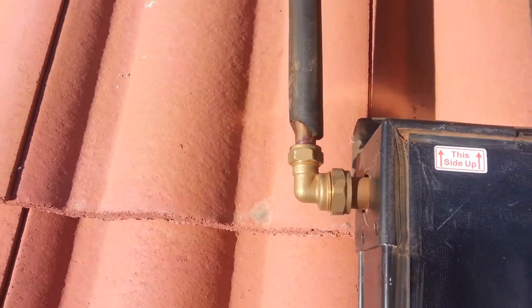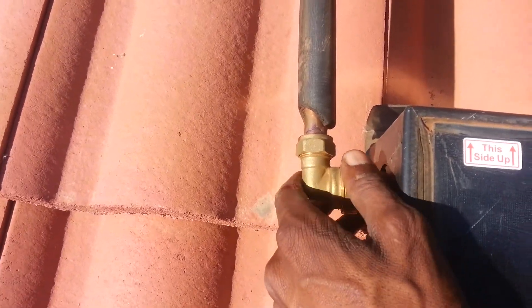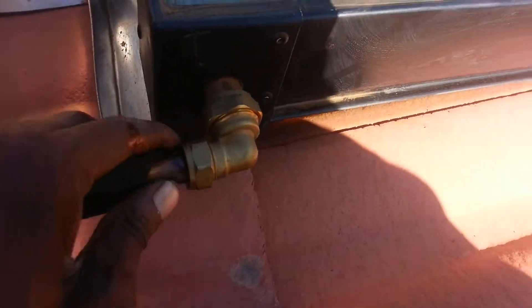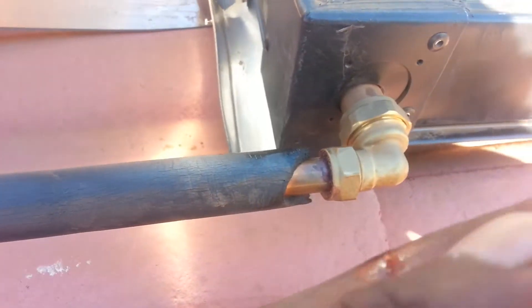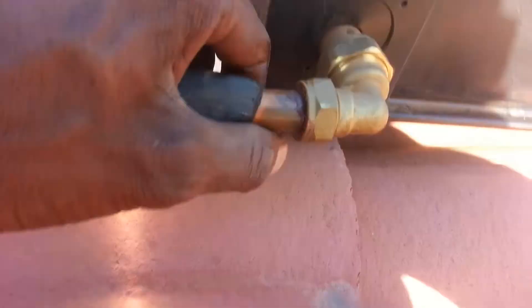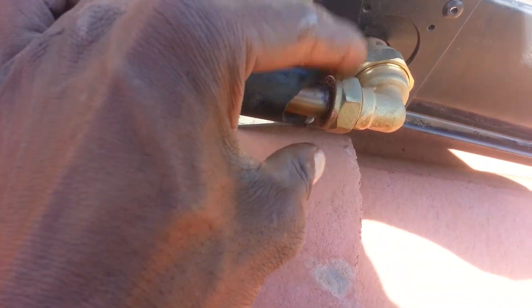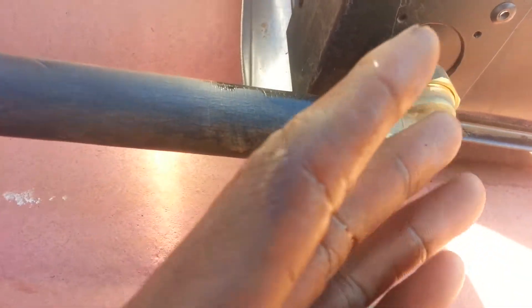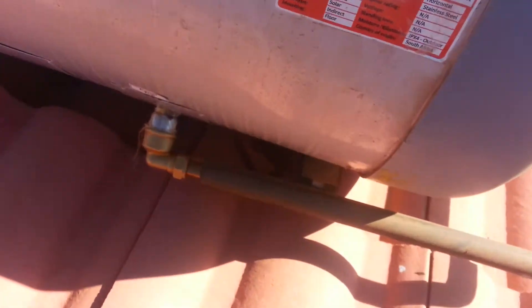Here's the top panel — it's hot, getting water. So we'll take a wrench and tighten it up. As you can see, I can see some glycol here — I think it's been leaking. The glycol has been leaking; maybe this is the cause. This is suspicious. If I tighten this up there should be changes. My fingers are oily, shiny, and the other part of the top panel is also hot.